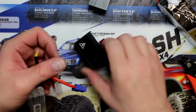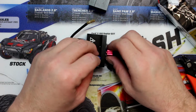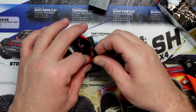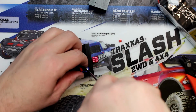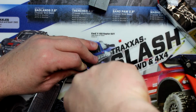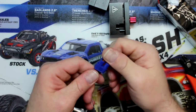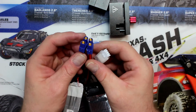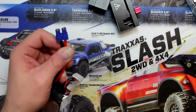And let's split the jig in two. Tighten it up and grab our wire. Screwdriver, and here's our click. And we're done. Confirm again: negative, negative, positive. Same thing as this one right here. Put them side to side. There we go. This is how you do EC3s, guys.